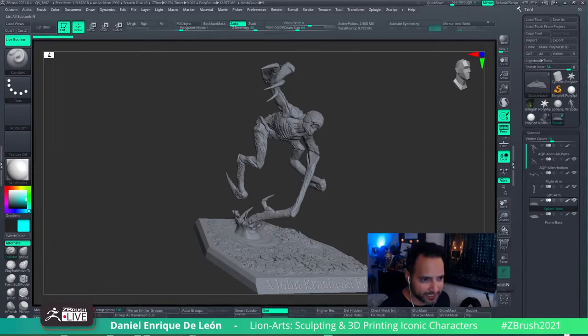Thank you. Did I use any supports for the printing? Yeah, definitely. There was a bunch of different supports. Mostly, the creature was on its back. That's how that printed. And then the arms were just at different angles. I kept them rather low, past 45 degrees, so that all the arms needed supports from some angle. But the hand was printed up this way, with the claw fingers going away so that they didn't have supports on the tips. But I kept them lower angle because, again, the less amount of layers it has to go through, the faster it's going to print. And I also put it to the lowest printer settings.